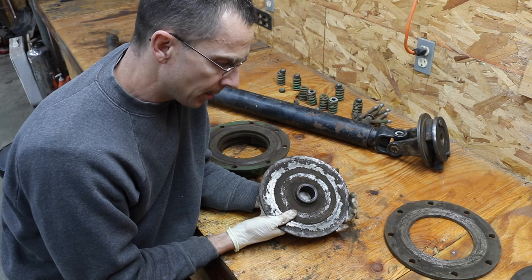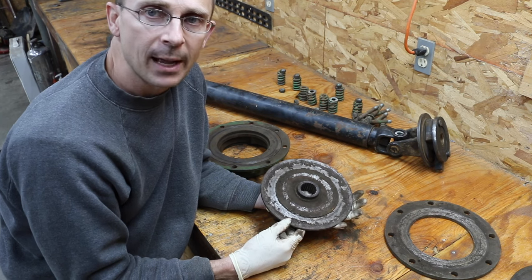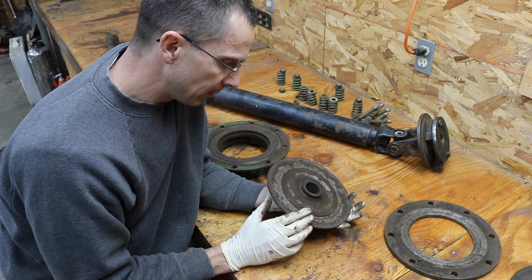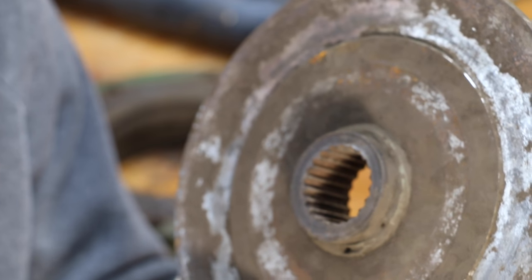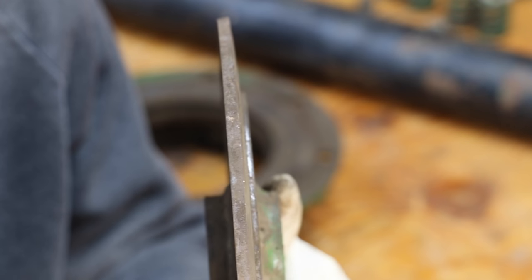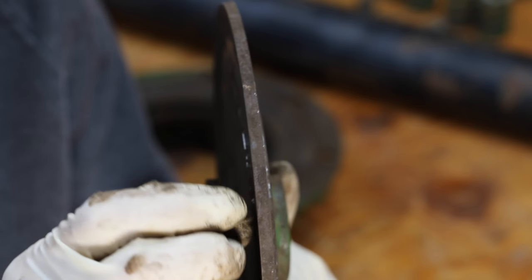This part was $110 to replace at John Deere — that's a lot cheaper than $1,500 and easier to replace. The friction discs are about $25 to $30 each, so fixing this is relatively affordable compared to the potential damage if it isn't working properly. If you look carefully, you can see the splines on this slip clutch are badly worn. You can also see that this disc assembly is actually warped — the top edge is leaning to my right, your left.